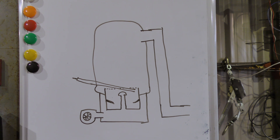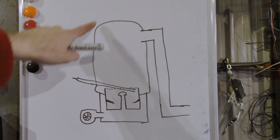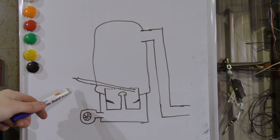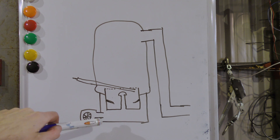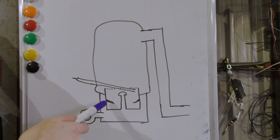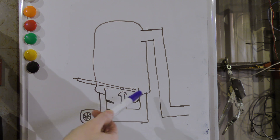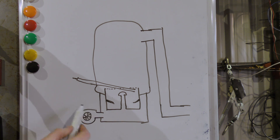Here is a sort of badly drawn representation of my burner. This bit on the outside is an old hot water tank. It's still got a coil inside if I wanted to put water through it and heat radiators and whatnot. Steel hot water tank - the bottom bit's a bit of an old gas bottle. That bit there, that's the fancy burny thing that I bought from eBay. Essentially it's a stainless steel drum with lots of little teeny tiny holes in it that puts the air into the fire. So this is the source of my air - this fan here.